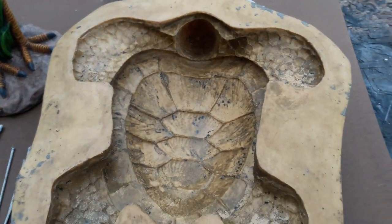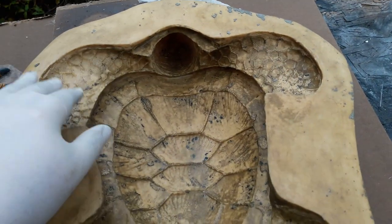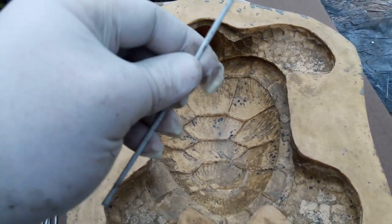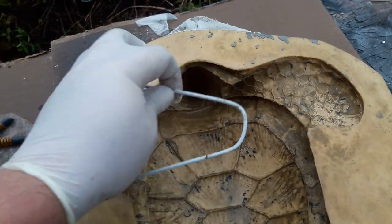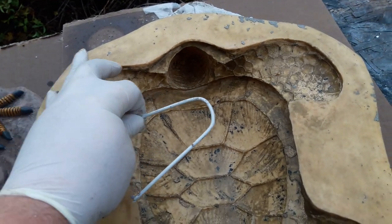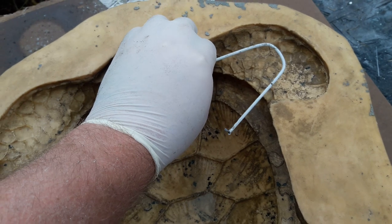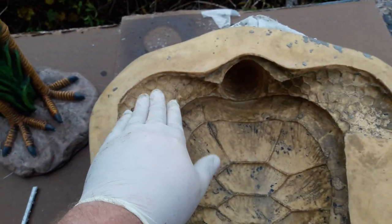The other kind of pieces — if you look at this here, this is a sea turtle. The statue itself that comes out is nice and thick, but the legs or fins — whatever those sections of the turtle are called — are considerably thinner than the body. I've never had one break, but just to be safe, I take these thin wire pieces and bend them like this. I'll fill the mold with cement almost all the way, shake it to get the air bubbles out, and before the final addition of cement to trowel it off, I take these and just press them down into the soft cement mixture about halfway down into the leg. I'll do that in all four, finish my mold work, and they just provide extra strength for those legs.